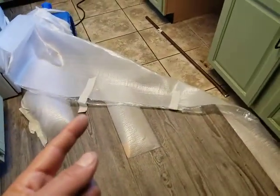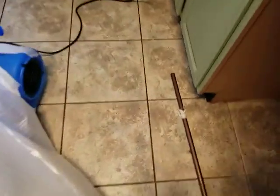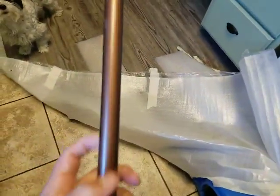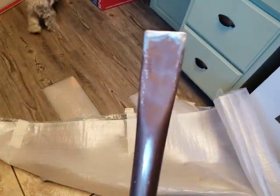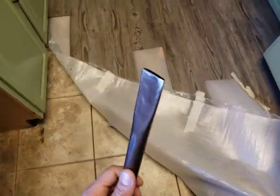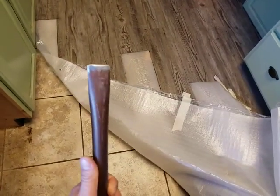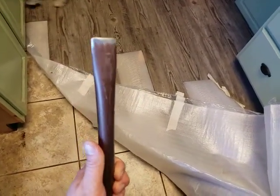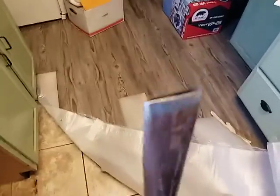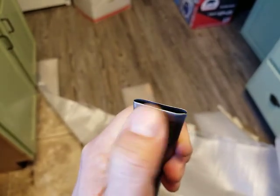The key tip is to get some sort of slim pipe — this one is from an old shower curtain rod or window curtain rod. They're soft and easy to bend. What I did is smooth down the edges so it doesn't cut the padding that goes below the vinyl planking. I smashed the ends down with a hammer against a piece of wood, then used sandpaper or a cement sidewalk to make the edges nice and smooth so they don't snag the padding as you push it through.